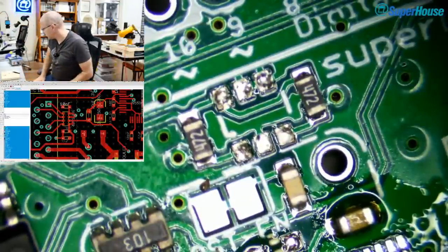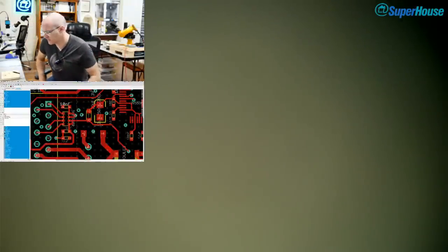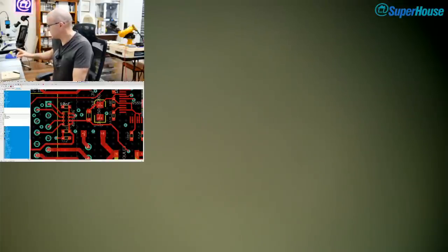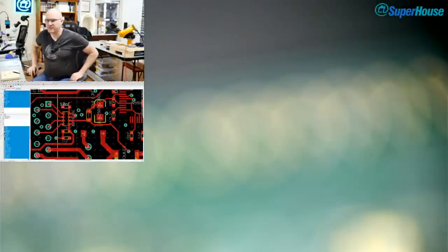So now I'll switch it into cool down mode and shove that back out of the way. I normally leave it running in cool down mode for a minute, not so much for the benefit of the board, but for the benefit of the preheater. Because if I turn the preheater off when it's at peak heat, the airflow stops, and then there is potentially a problem with heat soak and overheating the mechanism of the heater. But that's been running for a minute now. So I'll turn that off, which will be a great relief to everybody.